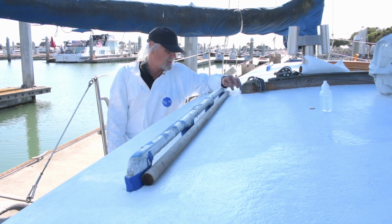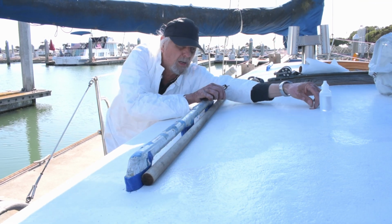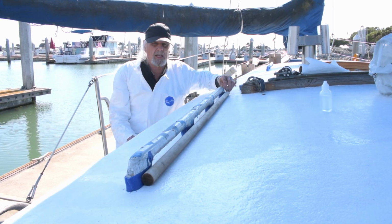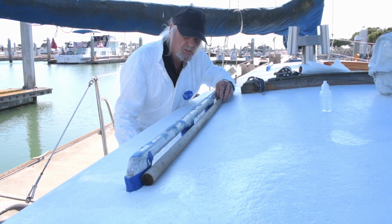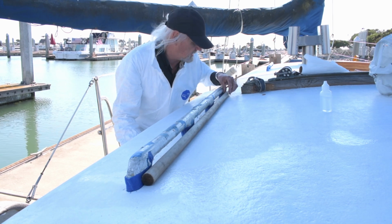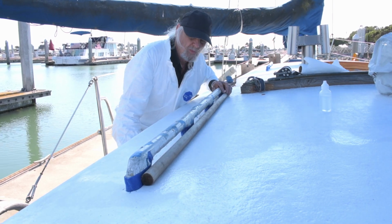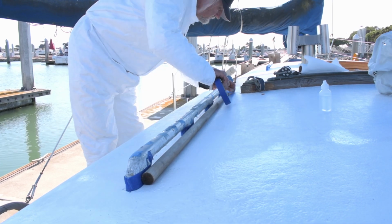And then I'm going to probably tape and round the corners a little bit, using a penny for my radius. I think that might be the right size. So let's see what happens. I'm using this wooden dowel here just for a guide. It's 1 inch in diameter, so I'm just going to kind of eyeball it around here to get the distance that I need, the 1 inch space on each side of this rail.